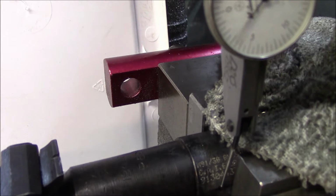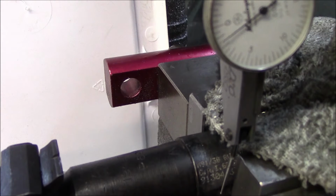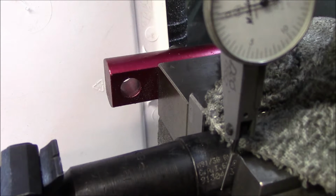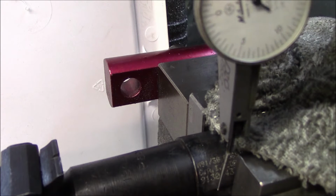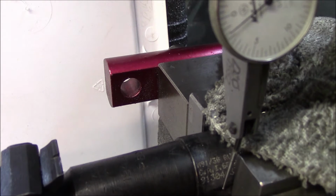At first I picked up the back side of the jaw with an edge finder, and then I'm going to come over here with a test indicator, and I'm not going to be able to show you the back side, but I have this zeroed. You bring it down in Z past the high point of that radius on the receiver, get your zero, and then move your spindle left and right. Get your zero that way.